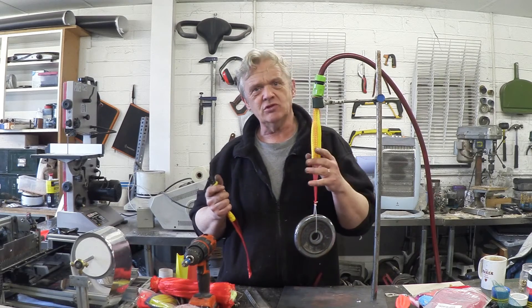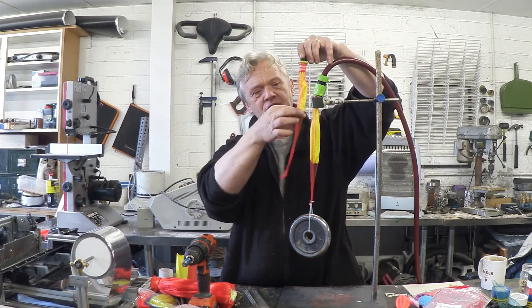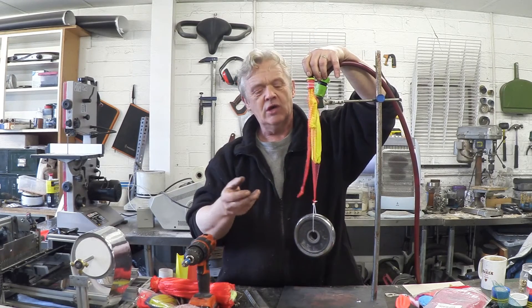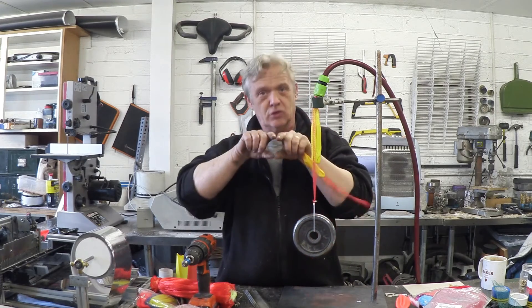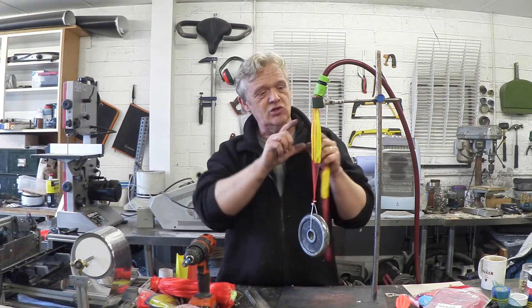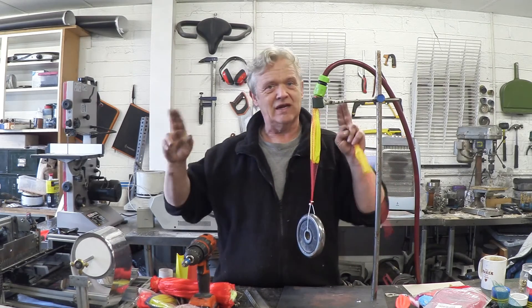It seems to suggest I'm on the right track — to improve these muscles, we need to concentrate the expansion at the top and treat the lower portion as a tendon, just like in your own muscles. With McKibben muscles, the whole area is allowed to expand and then it contracts because the whole tube is expanding. If we want to improve contraction on McKibben muscles, we need to concentrate that expansion at the top of the muscle, allowing the bottom to act like a tendon.